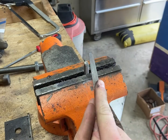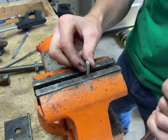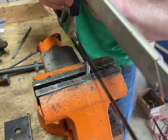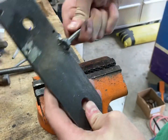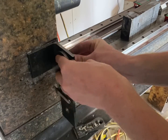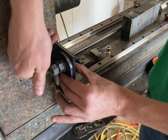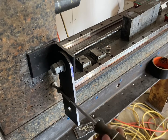I used a three-sided file to put a quick notch in the bottom of the bolt, and I used my hacksaw to cut in the flathead. Now I can go and put the major bolt back on and double nut it again to hold it in place. And now I can just take my flathead screwdriver and turn the end, and it should tension it.